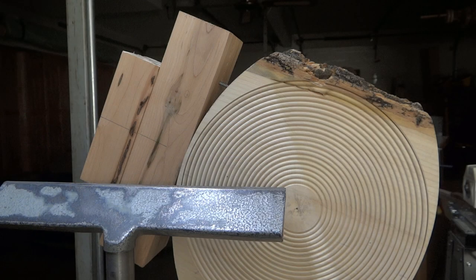I managed to balance this out fairly well with two different steps. First, I added this counterbalance that you see on the left side of the screen. The longer piece of wood was added, and then the shorter one. It was still too heavy at that point, so I slowly took off the thickness from the shorter piece, a 16th of an inch at a time, until it was very close to balanced, and then I dropped that down to taking off 1/32nd of an inch until it was balanced so it would sit like this and not turn.